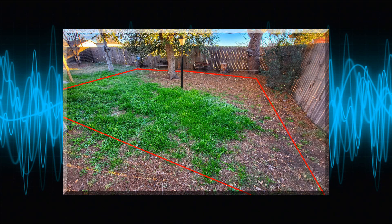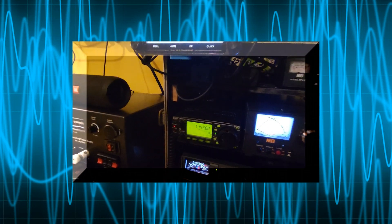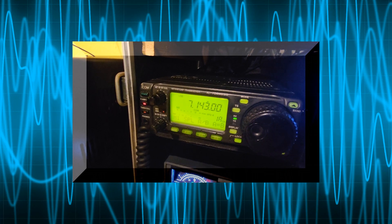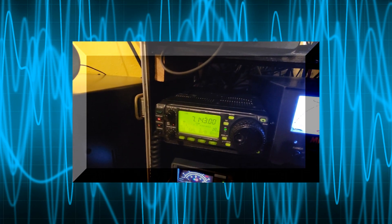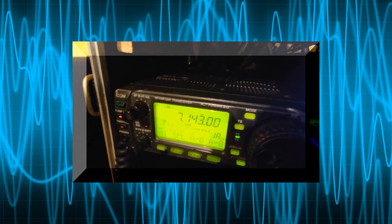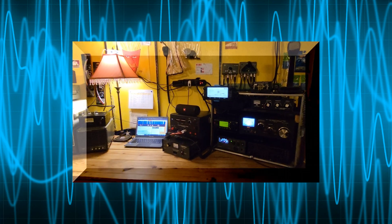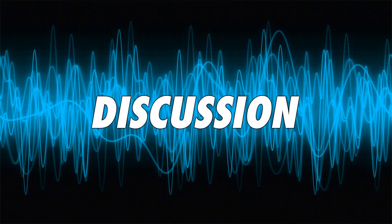This video will show just how much noise it cuts out without cutting out a lot of signal when everything's right. This was a really noisy night on 40 meters. Here's 40 meters on the loop on ground — then switching to the 40 meter dipole, listen to how much more noise there is — then back to the loop on ground. Pretty drastic difference. I thought that was pretty cool — a couple of you asked me to put a video online. You can see right there it makes things a lot more pleasant on a noisy night.